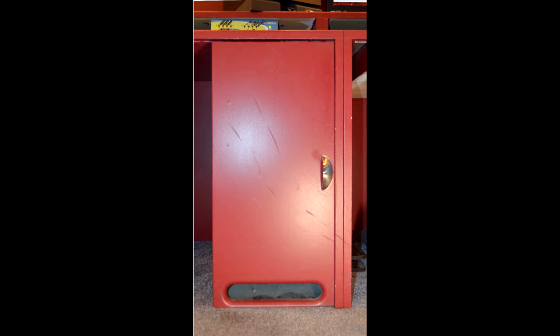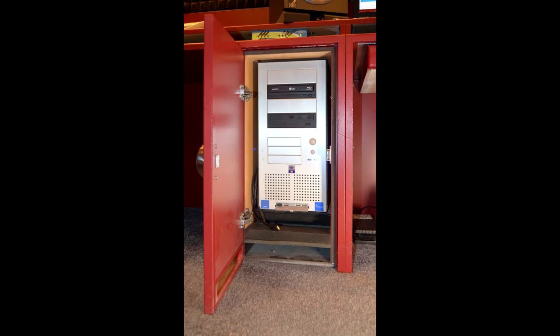I'm now going to discuss how noise created by the studio DAW PC is almost entirely suppressed from entering the room. This is a front view of the acoustical enclosure with the door closed. The air intake is at the bottom of the door, and I selected a door handle that would reduce the possibility of snagging on clothing. The DAW computer case is butted up against an opening in the rear panel of the left main unit so that exhaust air and fan noise are directed down into the platform plenum space and then exit at some distance before entering the room. Every doubling of distance in free air results in sound levels being reduced by half, or minus 6 decibels. When sound travels in a convoluted path, there is an opportunity for absorption of the sound waves by the surfaces it impinges on. A foam seal around the rear opening ensures that air and noise cannot escape at that location.